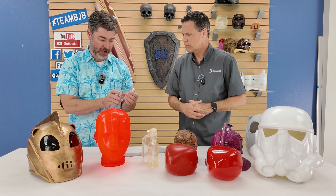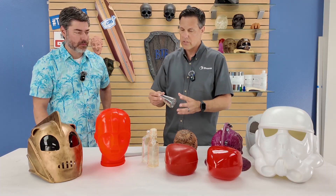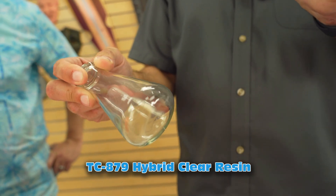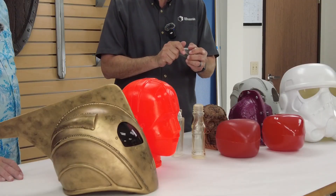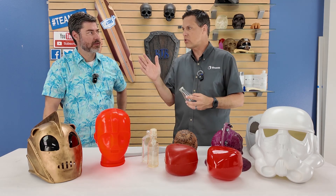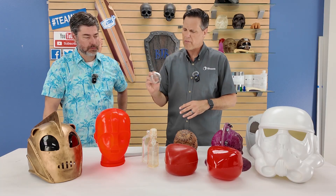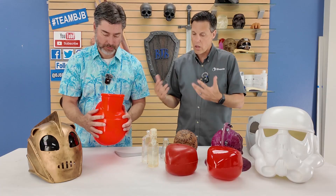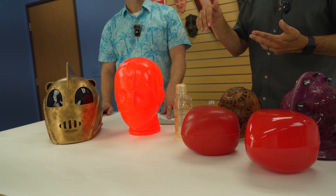This is beautiful — you nailed the kind of glass look of that. Which material is this? This one feels a little harder than the others. So this was our TC 879 — a hybrid aliphatic. It's not a hundred percent one of our water clears; it has a little bit higher heat resistance and a much higher impact strength. Very strong, but with enough flex — I can whack this on a table and it has great impact. It rotocasts very nicely because it has a mid-grade viscosity, not too low and certainly not too high, and it just seems to form rotocast parts beautifully. We have a longer working time version — this one's about a five to six minute working time — and then a 15-minute working time version, which is what this head was done in. It takes color very well: bright colors, neons, glow powders. Mix it, vacuum degas it, and get it poured in carefully to avoid bubbles.